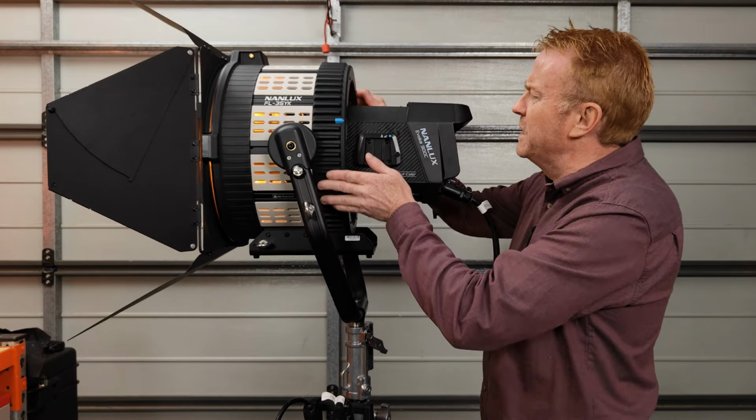Now let's have a look at the white point placement measured in delta UV. And from 2400 Kelvin onwards, this light tracks extremely close to the Planckian curve. But just to note, it doesn't deviate to the daylight curve. Here are the results between 8000 and 20,000 Kelvin, measured at 1000 Kelvin increments.